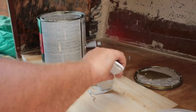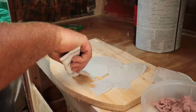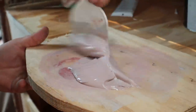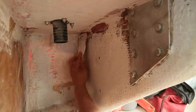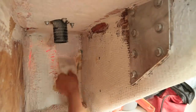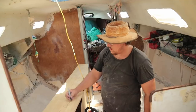We experimented with using some auto body filler — a two-part thickened polyester resin — to smooth out some areas needing flattening and to create fillets wherever the verticals and horizontals meet. However, we decided pretty quickly that it could only be trusted in non-structural spots. Compared to the West System epoxy, polyester is just very weak. We also created some homemade tools, including a compass for transferring hull angles to the plywood.